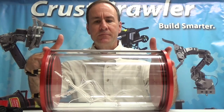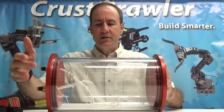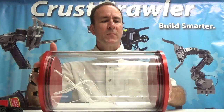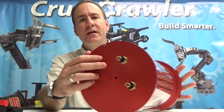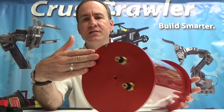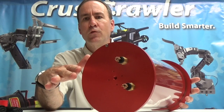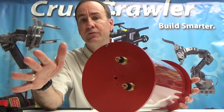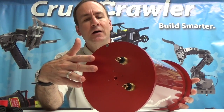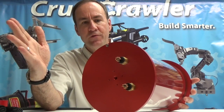The construction of it: we have two 303 stainless retention rods for the end caps, one here, obviously one here, and the end caps are made out of solid precision machined 6061 T6 aluminum. It has a hard type 2 anodized finish which is fantastic for corrosive environments such as salt water, fresh water, whatever environment you may use our waterproof vessel for.